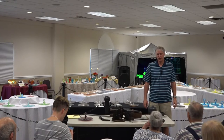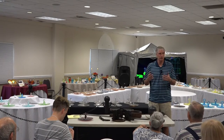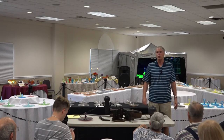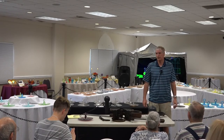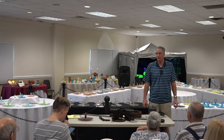The question was, what happens if it comes out of the furnace and cracks before you spray it? Can you reuse the glass? And the answer is yes. You can save it, break it up into smaller chunks, and then remelt it. Typically, we would remelt 15 to 20% of the glass, and that increased as we got more cognizant of energy costs as they went up.